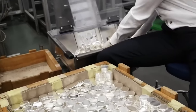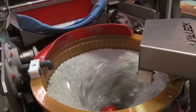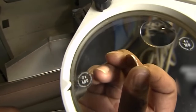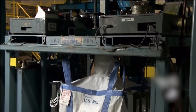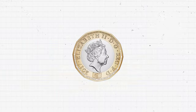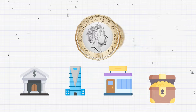The freshly minted coins may go through additional processes for finishing touches, such as burnishing, electroplating, or applying protective coatings to enhance their appearance and durability. The minted and finished coins are counted and sorted into batches, then packed in rolls, bags, or other containers suitable for distribution. The coins are distributed to banks, financial institutions, retailers, and collectors.